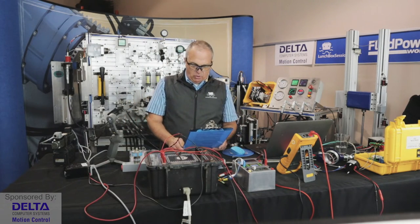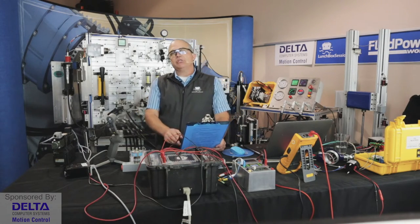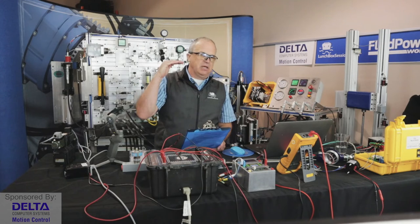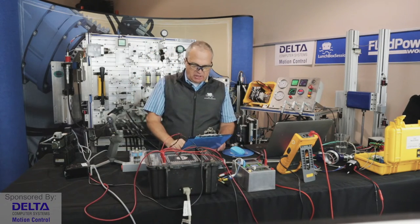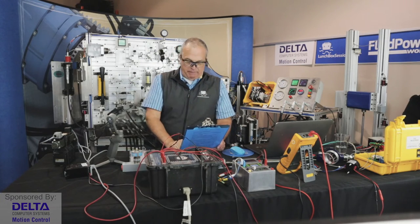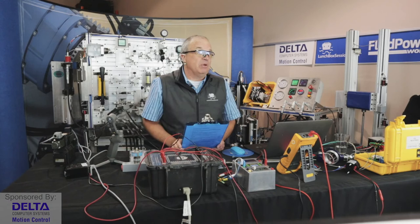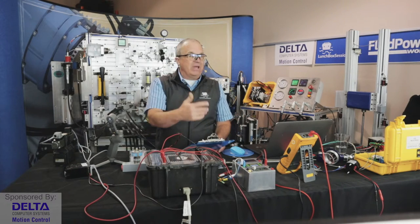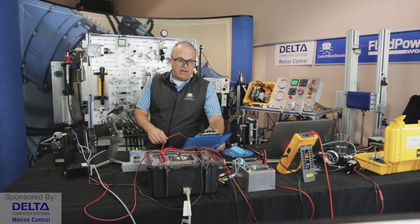And if you're looking for the answer to our pop question as to whether or not error is good or bad, well, the answer is neither. Error is just the difference between where we wanted that cylinder to be and where it was in the moment when we changed the command. And so it's neither good nor bad as long as your controller has an effective way to deal with it and close the gap in a way that gives you the closed loop control response that you're after.